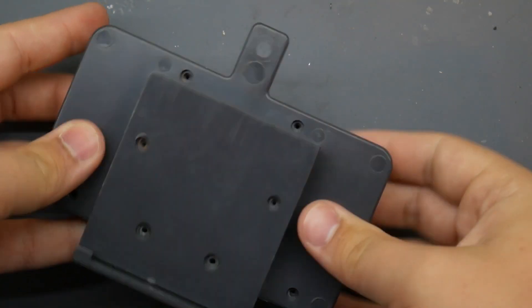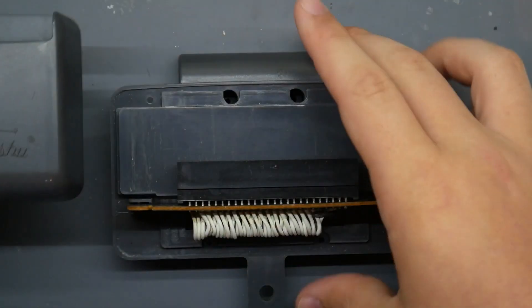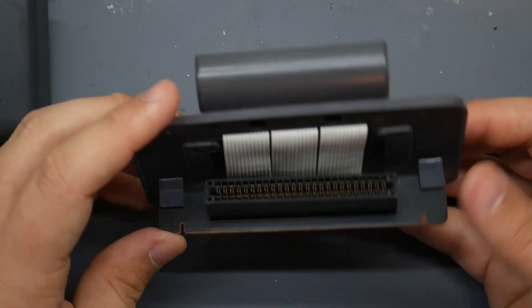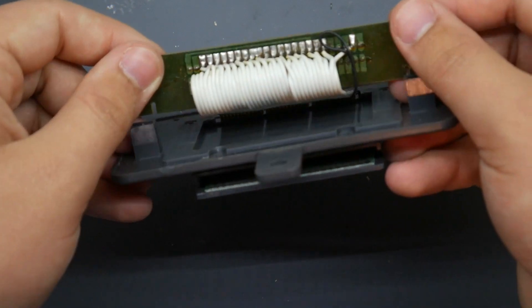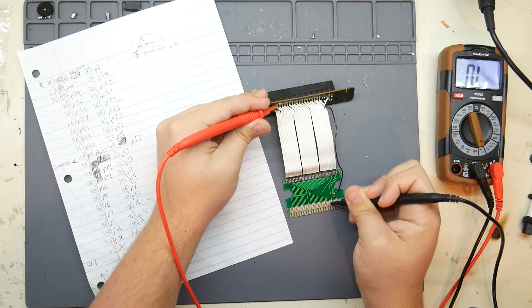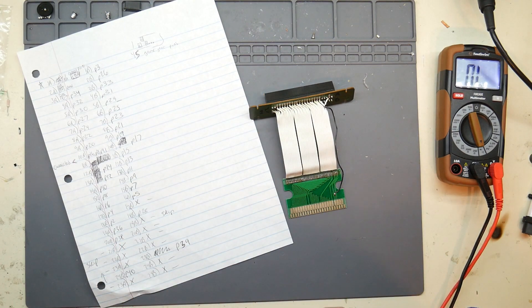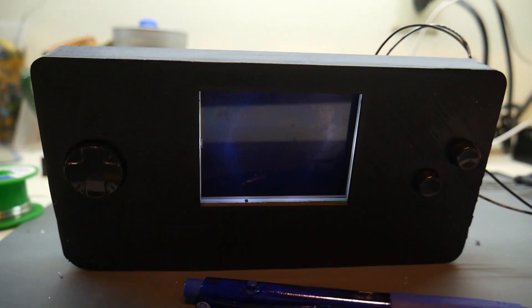The Master Gear accessory was released in the early 90s to play Master System games on the Game Gear. Since the Game Gear is really just a smaller, portable Master System component-wise, this seemed like a good move by Sega. When taking the converter apart, I realized there were no components on the board — just traces going from a Master System connector to a Game Gear connector. So I made a pinout going from a Master System connector to a Game Gear connector and wired it directly, bypassing the dedicated cartridge conversion entirely. I just wired the traces correctly, and it worked.